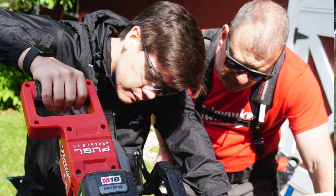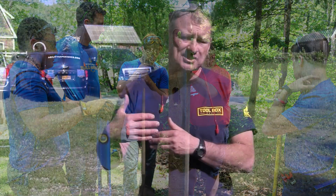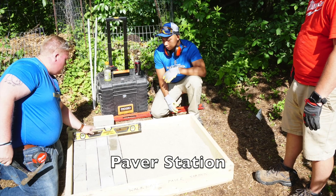Over the next two days, the different areas the guys will be trained on: day one, we'll focus heavily on tool and tool safety, tool use, nomenclature, proper stance, balance, using the core. Day two will be about building methods and construction methods, using the tools they learned on day one to start building projects — repetitive cutting, cutting patterns, measuring and layout, cutting materials off the stack with a circular saw, or fastening and drilling. They'll apply those methods and techniques to projects, and at the end of the second day, they'll actually build a small version of one of the projects from camp — the boardwalk project.